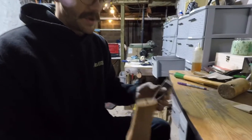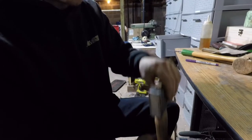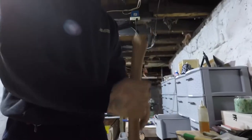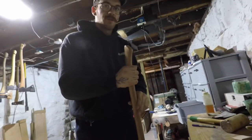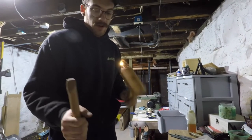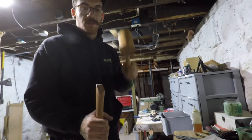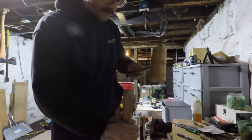So that's about the same shape as our eye — that'll fit nice. Now we're going to do our final fit. Place it on, give it a little tap on the ground, turn this upside down, hold it kind of loosely. We're not going to sit here and beat on this thing or you'll end up splitting your handle. One or two hits and she's home — you'll hear the difference in sound from hollow to solid.